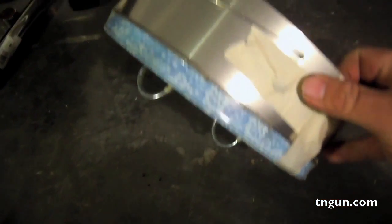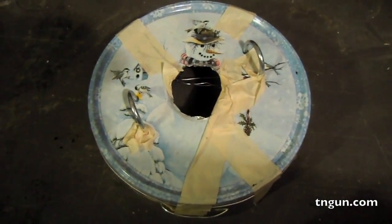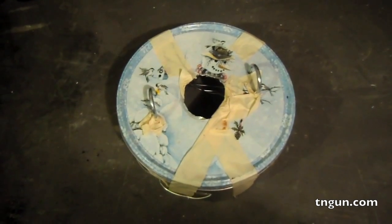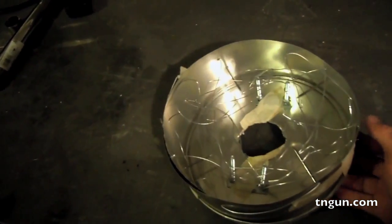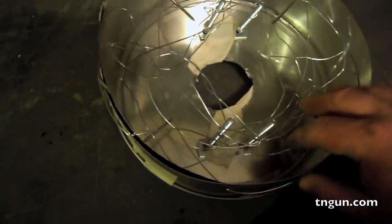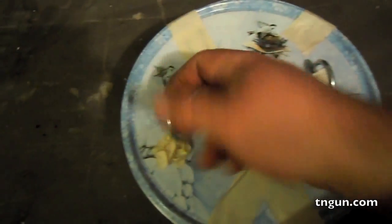Here's the lid. We went a little different than the Gingery instructions — they talked about making a cardboard form and wrapping sheet metal around it. I used this flashing; it's going to melt, I can almost guarantee it, but hopefully it'll last long enough to do the shapes. Right now it's kind of a mess of tape and wires — it'll get a lot cleaner as we burn everything off. I used the lid itself as a form, poked some holes, ran some wire back and forth, put the exhaust hole in there, added some nails, and also put these U-bolts in as a lifting eye.